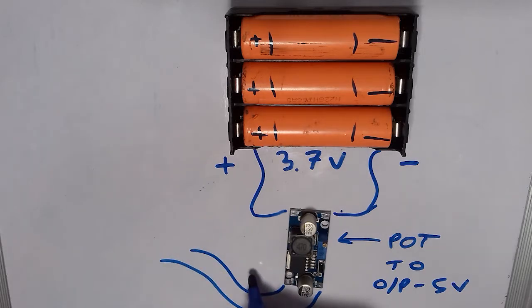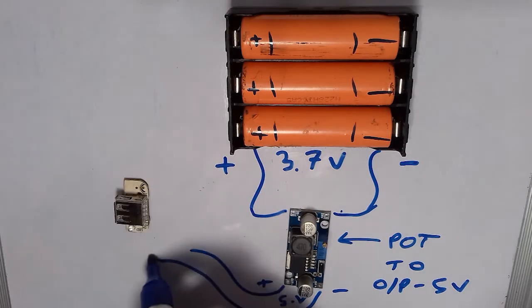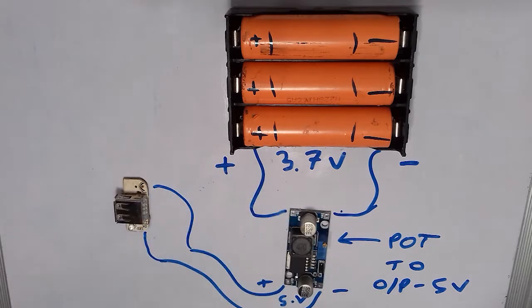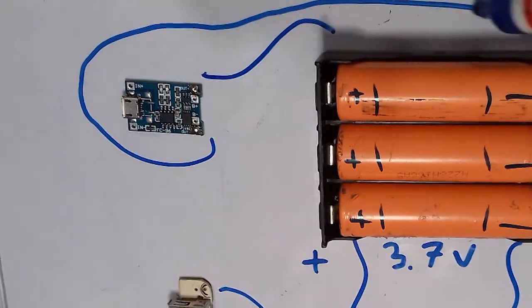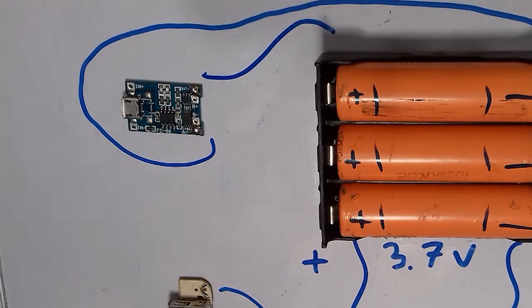According to my calculations, after the boosting and other losses, we will be left with an overall capacity of 5000 mAh. Connect the USB port to the output of the converter, and lastly add a charging module directly with the battery pack. For details on the circuit and more pictures, visit the link in the description.